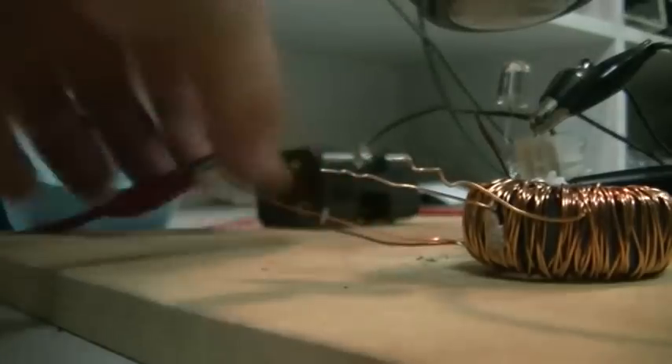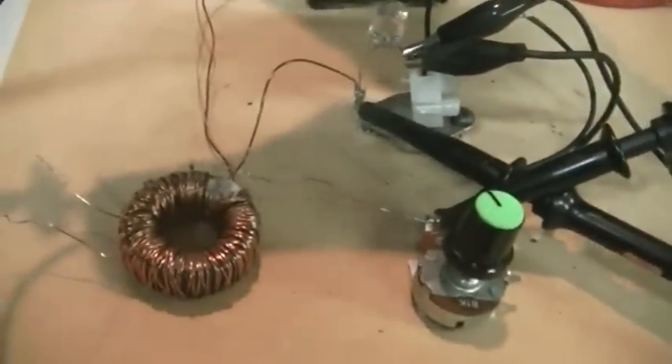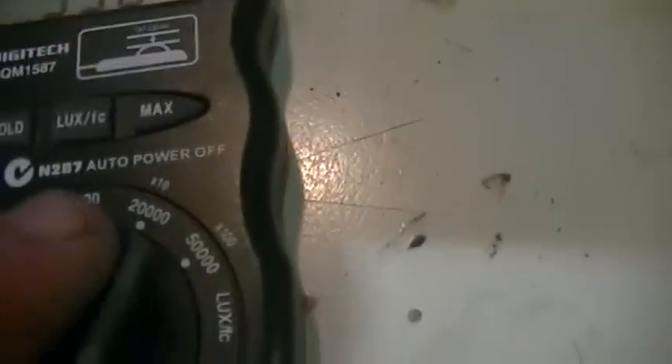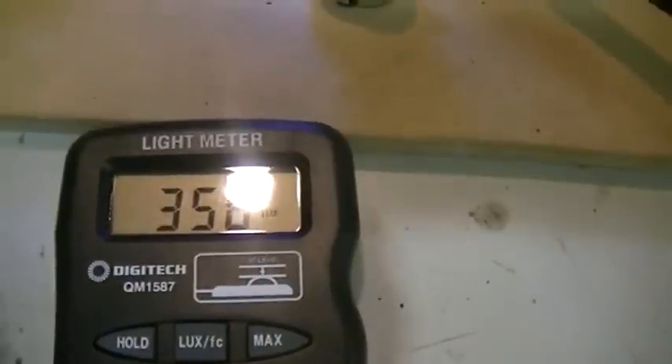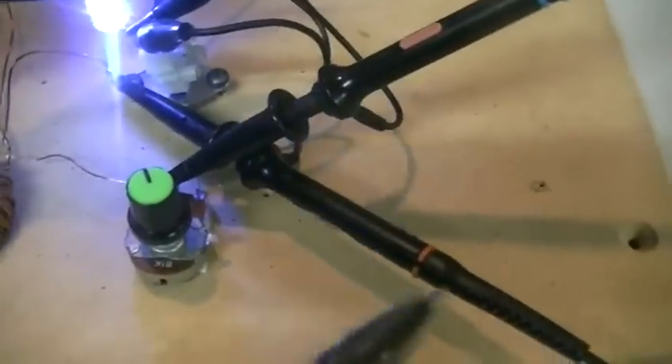I'll take the battery out of the circuit for a minute to show that the ambient light the light meter is getting isn't very much, so most of what we'll be reading is coming from the LED. It's only a 5-watt LED light I have above us, hitting the back side of our light meter. We're set on 10x on the lux meter, so we'll be able to see a change in light output quite easily with that meter as well as our scope.